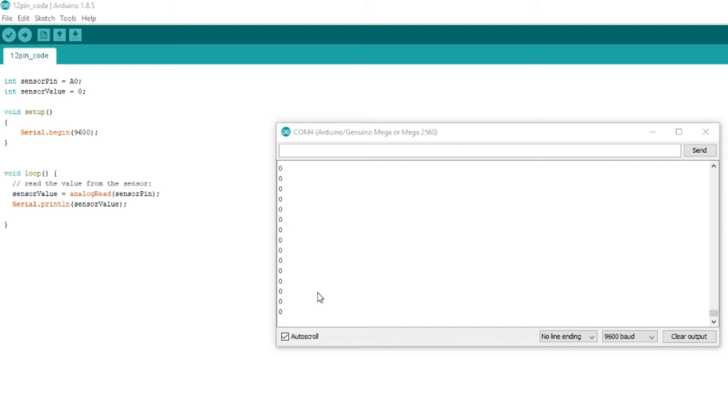The first line sets sensor pin equal to A0 because it's looking at analog pin 0. Then we set integer sensor value equal to 0 — that's the variable that will hold whatever it detects between the range of 0 to 1023. In void setup we just enable the serial monitor. In the loop, it reads the sensor value using analogRead on the selected pin and prints it to the serial monitor. As you can see, it's jumping between 100, 200, 300 — going up through each of the ranges, directly correlated to moving between resistors on the breadboard, incrementing about 100 each time.